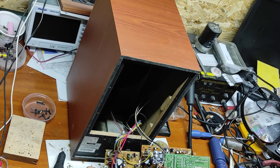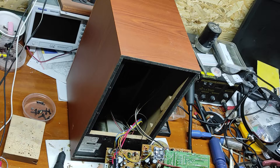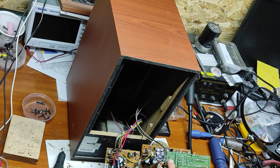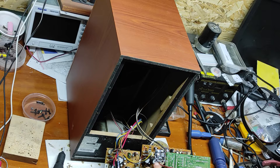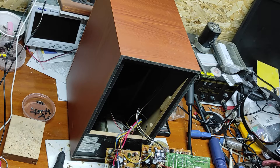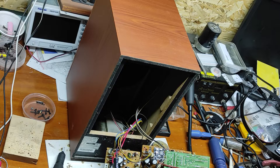So I mounted this module here and made all the connections. For supply I connected to the 5 volt standby voltage — we have 5 volts only when the speaker is powered on, and when it's powered off we don't. The outputs of the Bluetooth module are connected to one of the inputs.